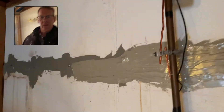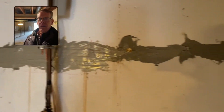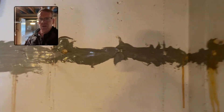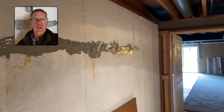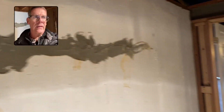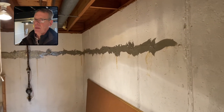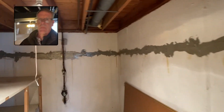This is typically not a structural crack. It is a place where the rebar in the foundation got too close to the surface. When it gets close to the surface, the steel can rust, and when it rusts it gets bigger and it pops — creating this web pattern. Is it ugly? Absolutely. Is it daunting for many? Yes. But structurally it typically is not a big concern.